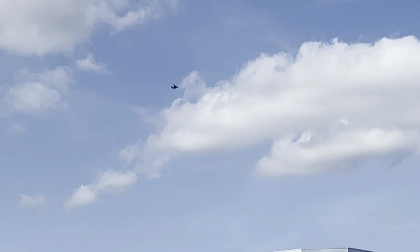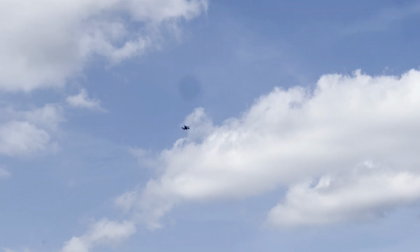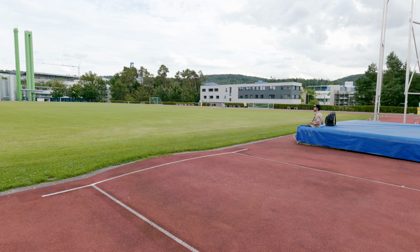Even one of the settings that we have to set in Betaflight is the value of the throttle that will keep our drone hovering in place. If any of these values are not chosen correctly or carefully, this might cause the drone to crash. So these values should be set carefully. And for that, I can make another video about this topic on how we can set these parameters and how we can set this GPS rescue option in the best way possible for our drone to come back safely.